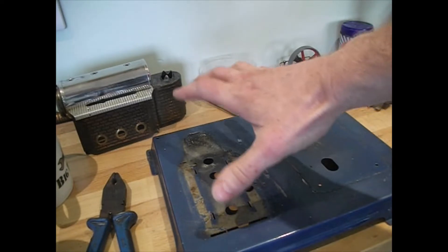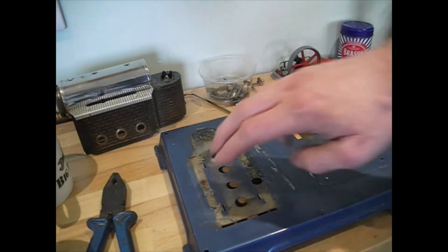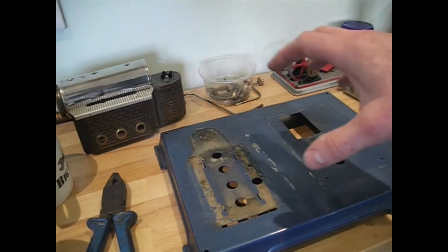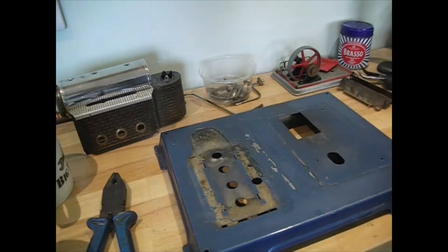I'm taking this back to bare metal on the top section — I'm going to leave the sides alone and then use a de-nibbing pad, a Scotch-Brite pad, to round the edges off, and then we'll be good for primer. There's going to be several coats of primer, several coats of top coat, and that'll all be sprayed in a spray booth. I do that inside but using an extractor to get rid of the fumes.